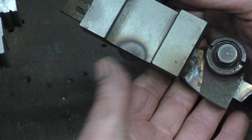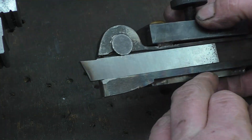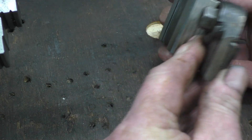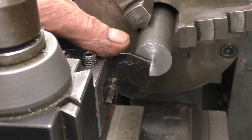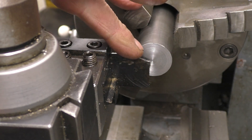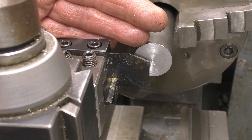Here's another one — it's a tool holder I made by welding a holder onto one that wasn't much use, and that works quite nicely. The three most important things about parting off are probably rigidity, rigidity, and even more rigidity. The stiffer, stronger, and shorter you can make the setup the better. The tool must be on centre height and at 90 degrees to the job.